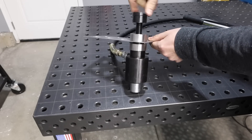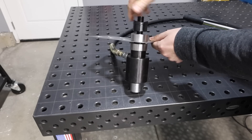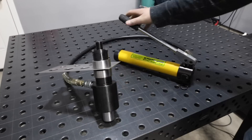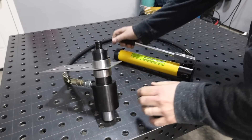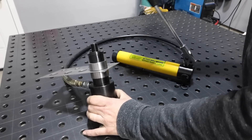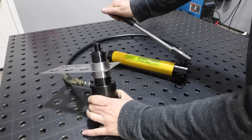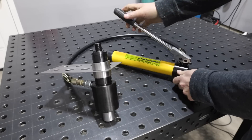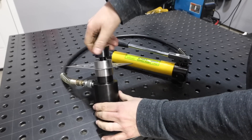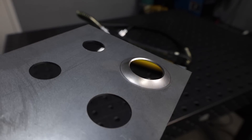This is just a cheap tool from Harbor Freight, used often in electrical enclosures to punch holes, but you can use the hydraulics on the bottom to activate a dimple die. You just thread it on like that, tighten things down, and press it out. This is the way I do it today and it works just fine. The problem is it takes a long time to go from one hole to the other because you have to thread this whole thing on and off. It does give a nice result though.